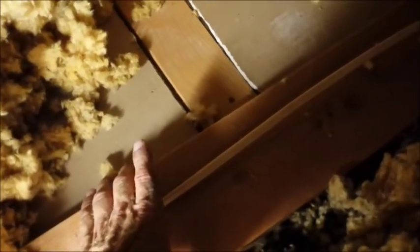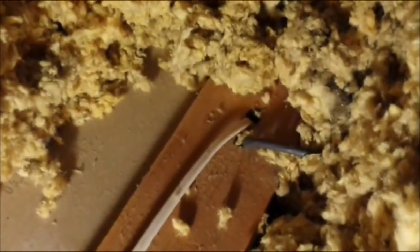We're up here in the attic now, and I've uncovered the top of this wall. You can see this is a nail plate that they put on top of the wall that the drywall is screwed to from the bottom. On both sides it's 2x6, which is wider than the 2x4 wall. You can see the top of the 2x4 on the wall — that's that small section of wall over our doorway and that's where the ceiling starts in our room. Now we know that about 16 inches over we have the box or the stud that the box is mounted to. We can see right here there's our 2-wire going down and our 3-wire coming up. So with confidence, we can now drill a hole just right in here somewhere to start fishing our new wire out of the box.